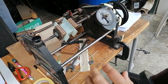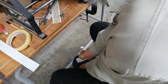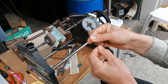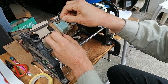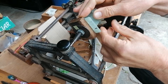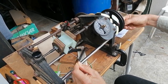For this design I have chosen 0.224 copper for the primary and I'm rolling it in such a manner that we have a balanced DC resistance on the output transformer. The first thing I do is zero my counter and fit the copper wire through the bobbin sides. I want to see more or less how many windings I get for one layer.